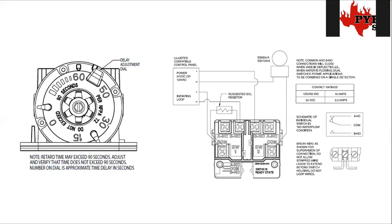Whenever you start having more than one water flow switch — like in those pictures where they have a whole bunch of water flow risers next to each other — trying to wire all of those in parallel can get confusing really fast. So we typically just throw an addressable relay up on the wall to help simplify it. You wire the addressable relay the same way, using the normally open and the common to switch that positive.